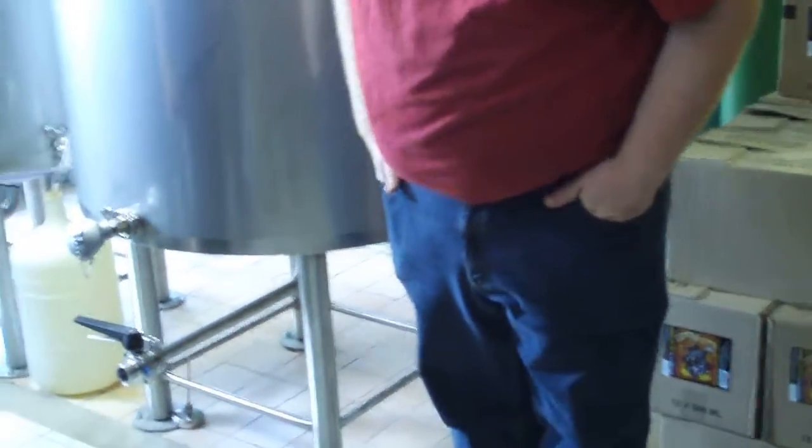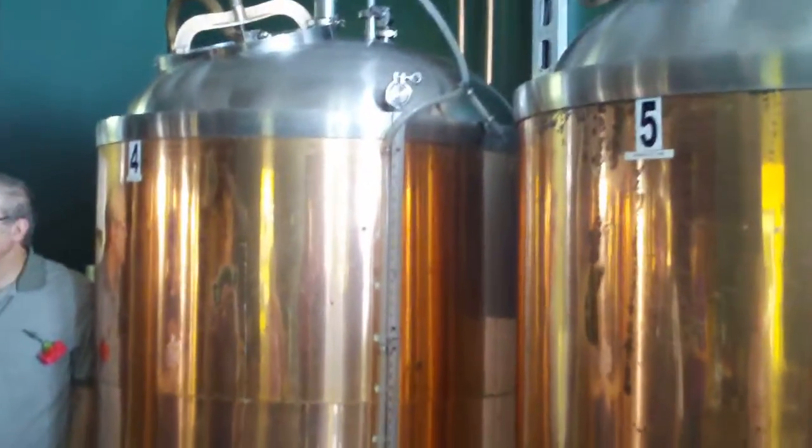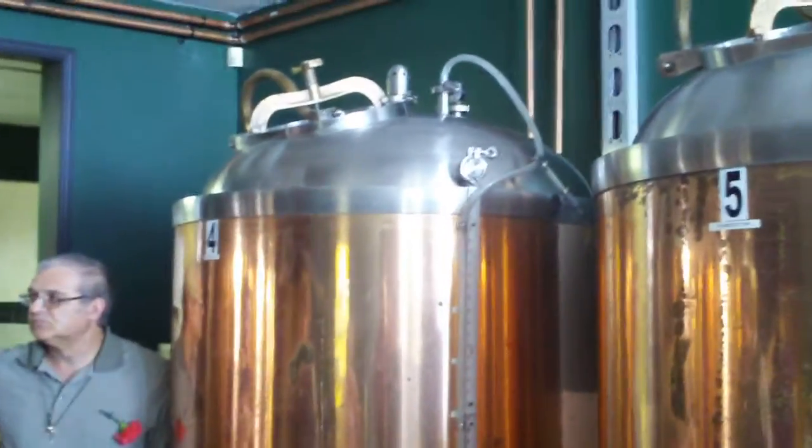As you can see, some of them are bubbling — number eight is bubbling over there. This basically allows no bacteria or impurities to get back into the beer. From there, it goes through the filter in the brew house into our bright tank, otherwise known as our money tank. This is where it becomes taxable — this is where we start paying the government for our beer. There's a carbonation stone in the bottom, and a full tank of beer normally takes about two hours to carbonate. The carbonation stone delivers CO2 instead of oxygen, similar to what you'd find in a fish tank.